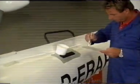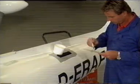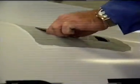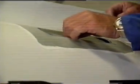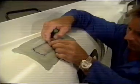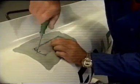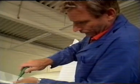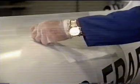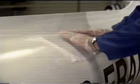Now the prepared repair insert is soaked in resin and a coating of micro balloons is applied to the surface. To make the fitting job easier, we insert a temporary screw in the middle of the repair section. Two additional screws on the right and left hold the composite patch in place until the resin has cured. Now another couple of fabric layers and a few hours of curing time.